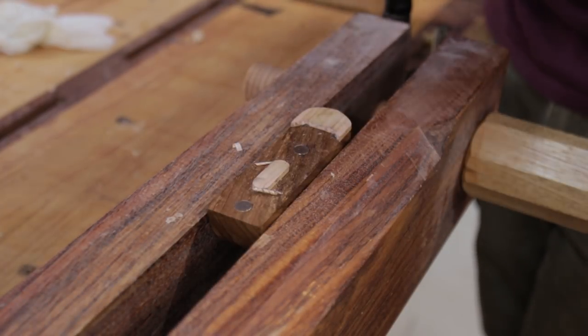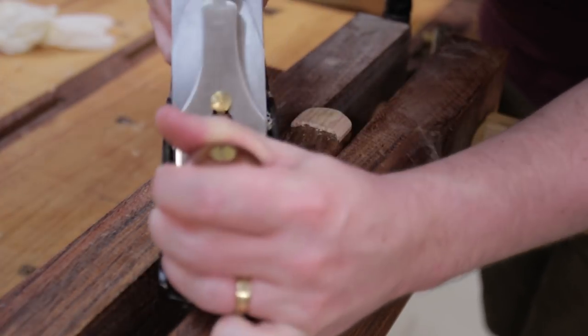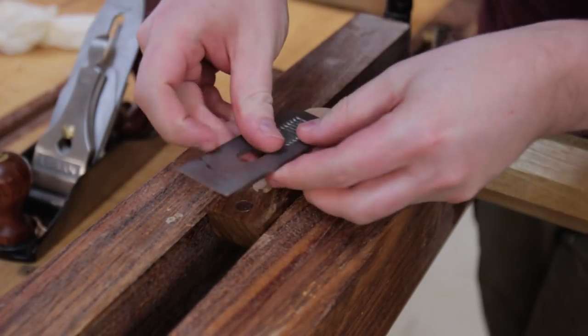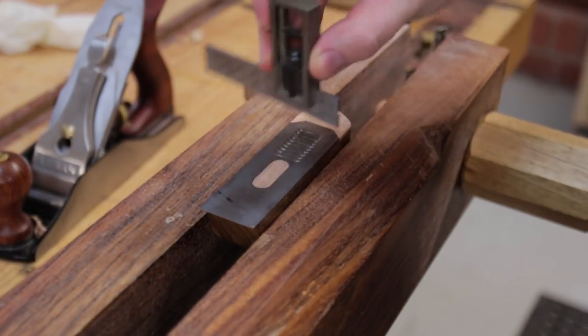The sole parts were just very slightly above the thickness of the plane blade. Since these aren't actually the reference parts — the blade itself is — it's better to have them slightly below the surface of the plane. So use a plane or sandpaper to reduce their thickness.